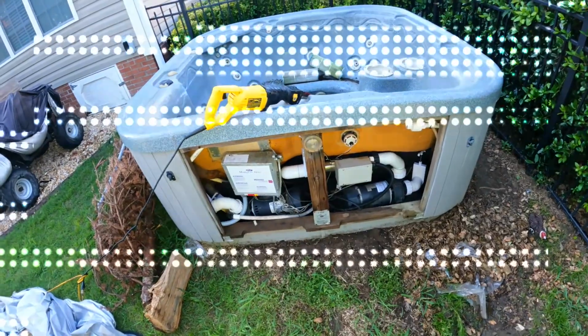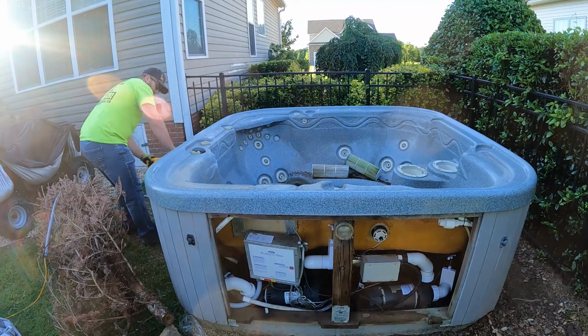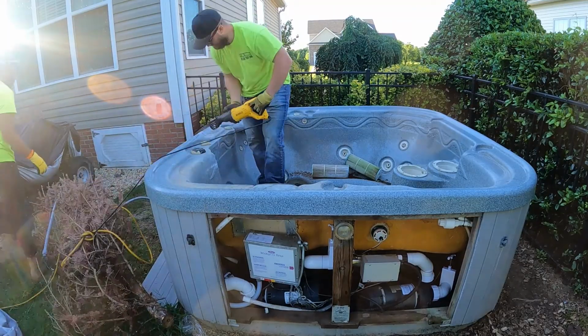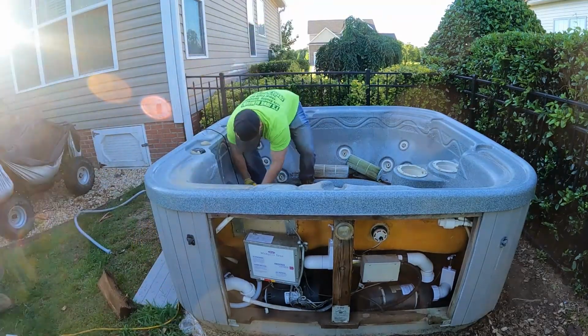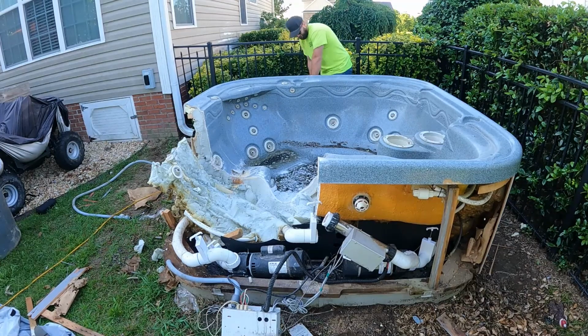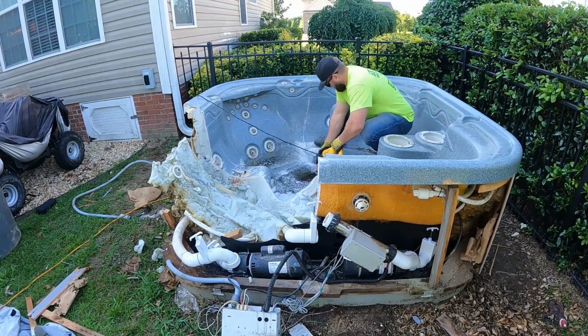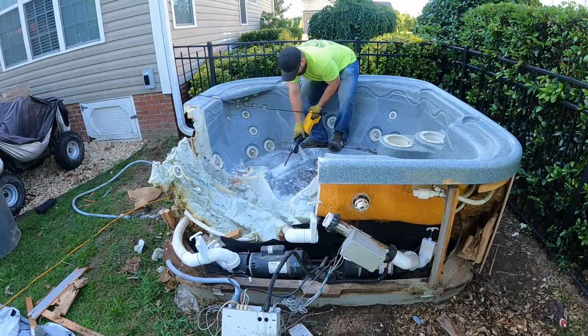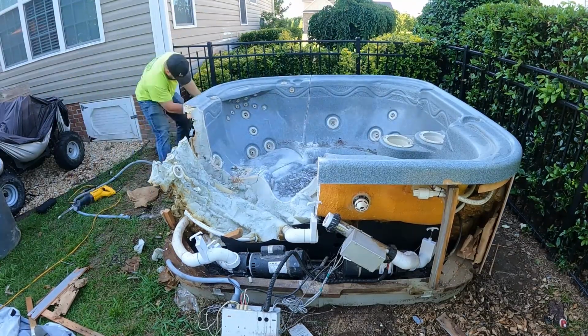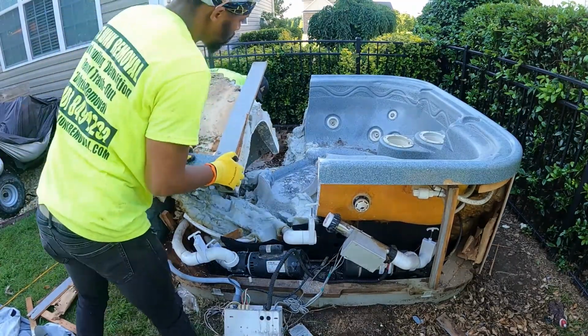The base, we'll get there. If your hot tub does have a lot of water and you don't have a drain, just simply cut around the fiberglass in a few different spots and let the water slowly drain out. I'm going to link below the blade that I used for this hot tub. Typically, you shouldn't need more than 2 blades.